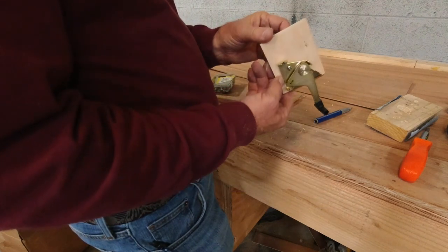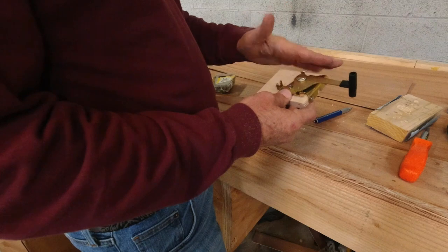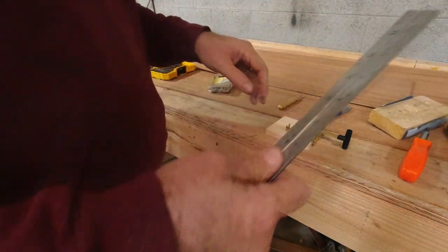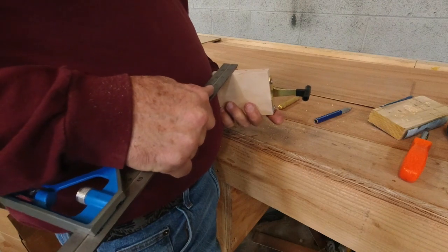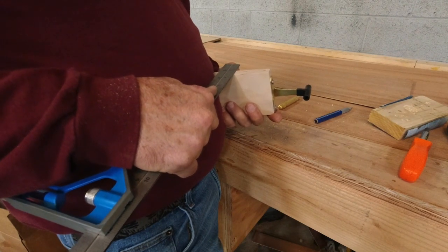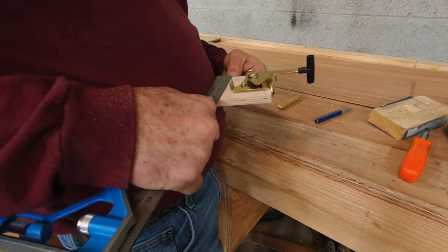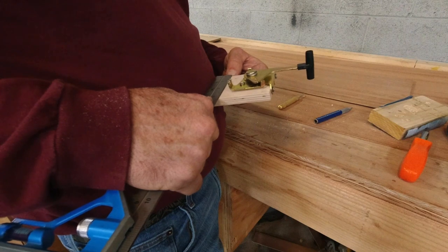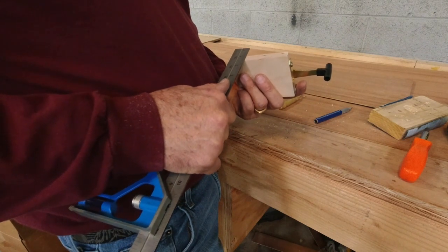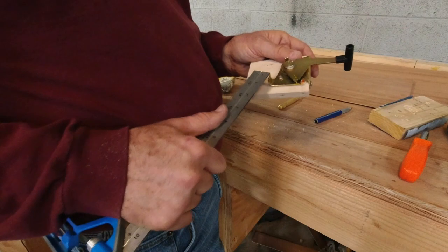Now, we'll get a piece of aluminum, and we'll make a cover for this. So that will be, let me get a couple of quick measurements here. And then probably not continue today, but I'm just gonna measure this just so I know. So we're basically 1¼ inches is gonna be the depth on the ends. And we're going to be 3 inches inside diameter this way. So 1¼, 3 inches, 1¼, and that gives us all the clearance we need. Yep, 1¼ clears this with plenty of space.